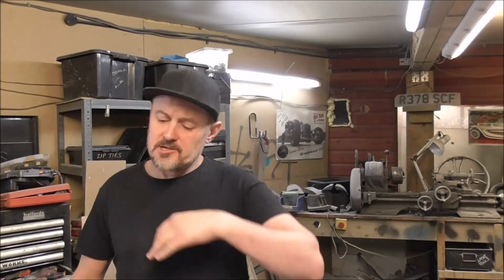Okay, so once the fibreglass part is cleaned, and we've taken off all the sharp edges and everything, we're going to start preparing it to actually make a part of the truck. That's going to include 5 coats of wax, some of this PVOH that we're going to spray on, then we'll go gel coat, then the fibreglass, and hopefully once all that's dried, we're going to have an actual component of the body of the truck at last.